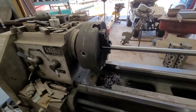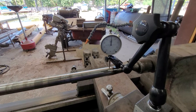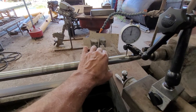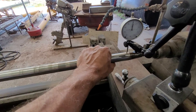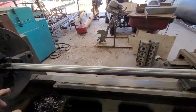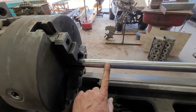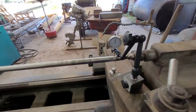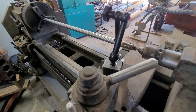So we've got this in the lathe with the RPM set low. We're going to turn it on and walk this dial indicator down to see just how bent this shaft is. When we had the new coupler on, this end of the coupler at idle was moving quite a bit. I suspect the end of this shaft is warped badly, but maybe it's bent throughout its length — kind of bowed throughout. We're going to turn this on.